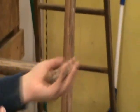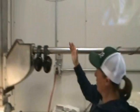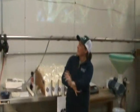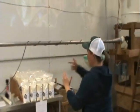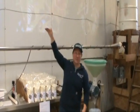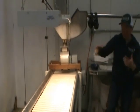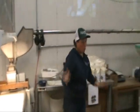So what this does, we have a hopper here that's warmed a little bit and has a fan blowing through it. We have this big long tube. The tube ends, there's a board here, and then a big suction fan at the top of that column of the pipe up there. That suction fan, and this is all airtight, creates a lot of pressure. It pulls the nuts really rapidly through this tube. So this is an impact peeler. Basically the nuts shoot through the tube like a rifle, crack against that bang board, the shell shatters, the shells get sucked up and blown outside, and the kernels, which are heavier, come down on the table, and there's a wheel here with an airlock release that lets them come down on the roller table, and then we can grade them out, pick out the ones that are fit for our flour, or ones that we reject.